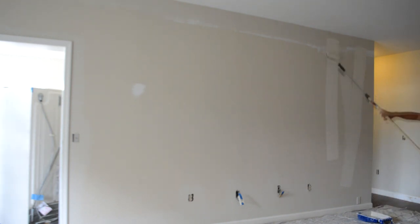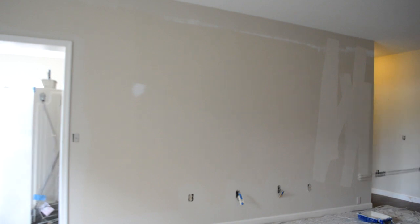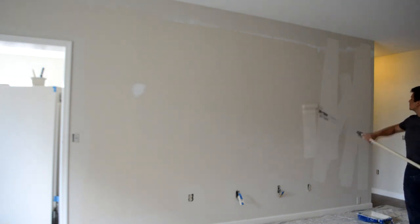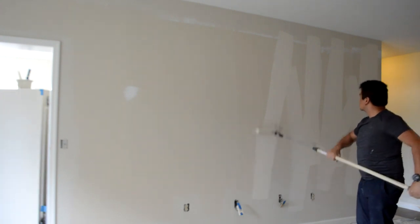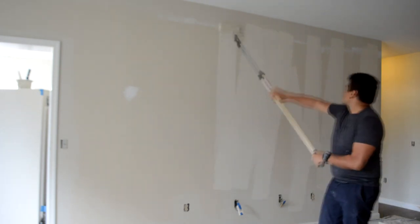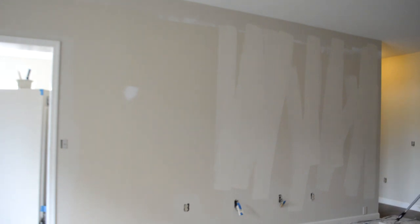This is the most important technique — I'm applying a generous amount of paint on the walls. I have two good conditions: I don't have a windy room, no fans blowing, and the surface is nice and dry. You don't want to do this in areas with a lot of wind because it will dry the paint too fast. This clip is not accelerated — you can see how fast you can cover once you have paint on the surface. I encourage you to cover the entire wall from top to bottom so you can control the amount of paint and maintain an even surface.